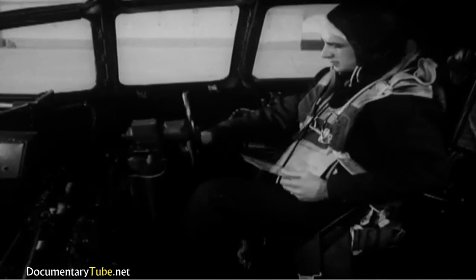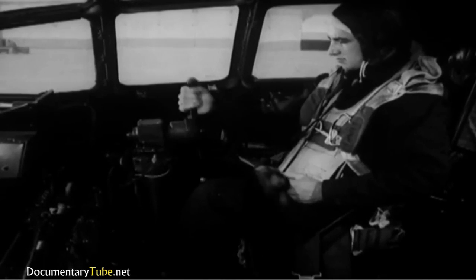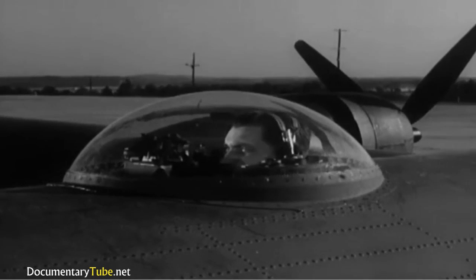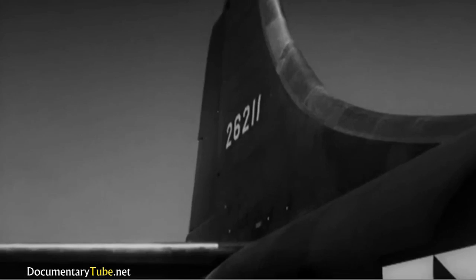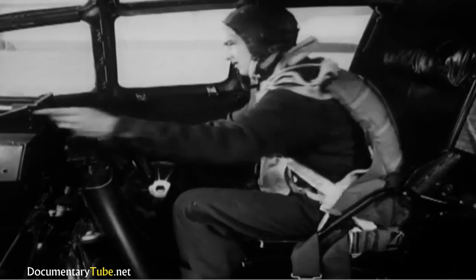He must test the action of the control surfaces, moving each surface, elevators, ailerons, and rudder, through the complete range. The gun commander looks from his blister, observing the response of the surfaces, and reports to the co-pilot. A similar test is made on the trim tabs.